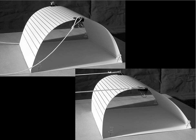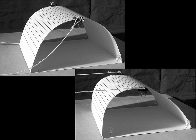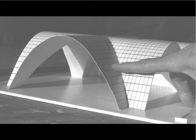Sometimes you can have mutually braced sheets of material where the materials are not planes, and the intersection may not be exactly 90 degrees, but there are two sheets of material that interact to create a stable core at some point. So here we have a barrel vault, which is fairly strong against forces parallel to the axis of it, but really weak against forces in that direction. So when we begin to stretch these strings, we see this tremendous deformation. We can now intersect those vaults, and down in the groove here, all this material becomes much more stable. And in fact, it becomes so stable that we can then go carve away the rest of the barrel vaults that are inside and produce this extremely open structure.